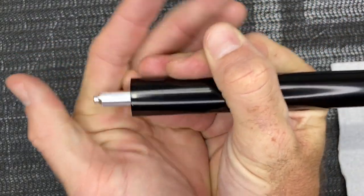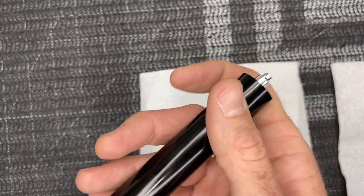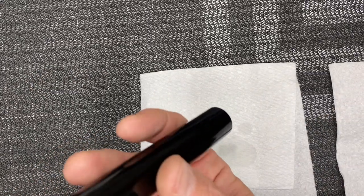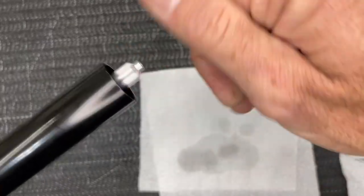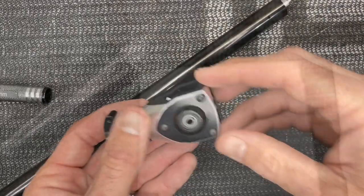This does make a mess. Take your torque tube and carefully push it through — get that first bearing to start, push it, get the second one to start, push it. The silicone oil makes it very easy and nice to do this. Get it to where you have an equal stick-out on both sides. The torque tube can still move back and forth in the boom. Turn the boom up, let any excess oil drip out, then spin it to make sure it's still free and smooth.